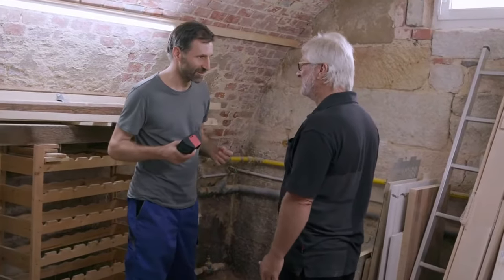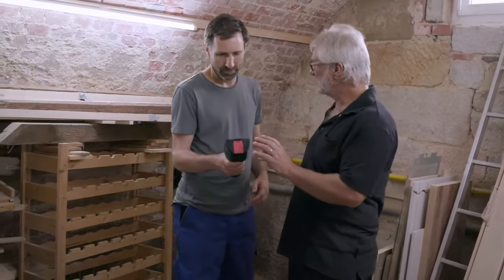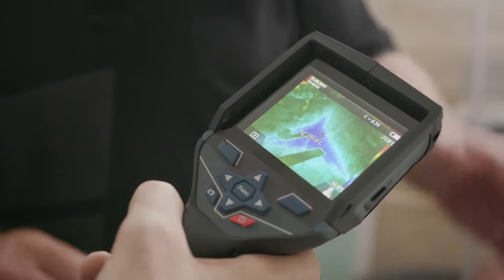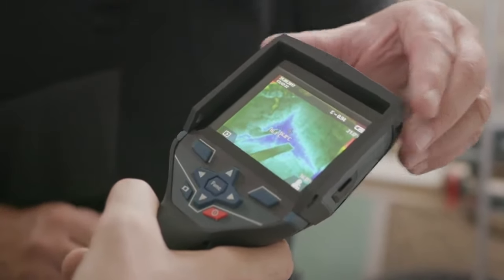You might be getting a whiff of something here. Yes, it smells a bit musty. There's a problem with damp in the walls — you can see it in this corner, for example. So now you know what to do: first we get scanning, and then we can look at the results. The most important thing is that you can see the coldest point in the image here — it's very clearly a different color in the temperature display, and you can also see the temperature around this point in the wall, which allows you to make a comparison. We have a lot of pipes and this room is really cool, which causes condensation to form. If we don't get rid of this moisture through ventilation, we will start to see mold form very quickly. And this mold can be really dangerous to the people living in the house, so we need to do something about this as a matter of urgency.